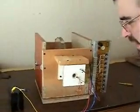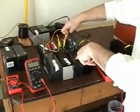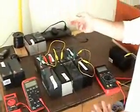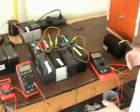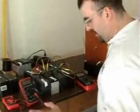We're going to look at two different sets of batteries. These are 12-volt 7-amp hour sealed lead-acid batteries. What I've done is series two batteries together to get 24 volts, series the second set to get another 24 volts, then series those together to get 48 volts. I did the same with another bank of four to get 48 volts, then series those two together — they should do 96 volts. We basically made a 96-volt battery bank here. Be really careful messing with batteries; again, you do this on your own will because batteries do weird things, and when they blow up, explode, leak, or break, they're very harmful.